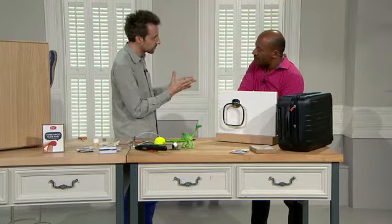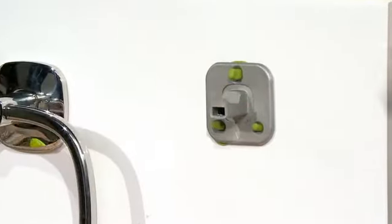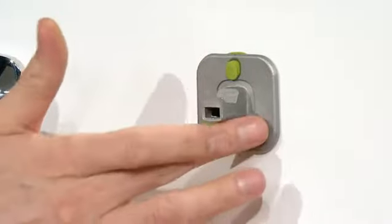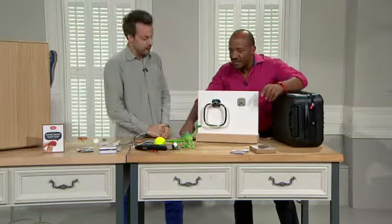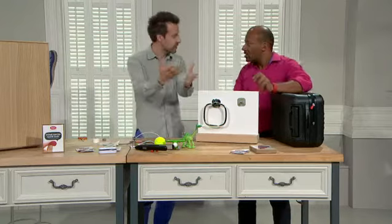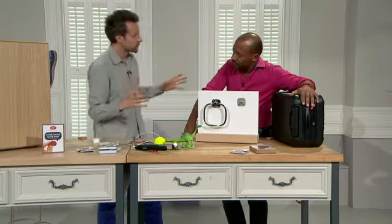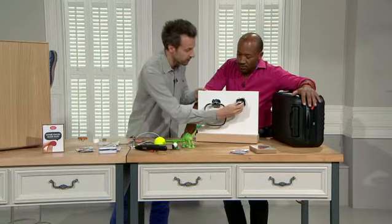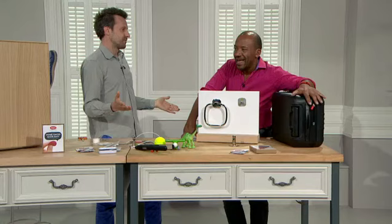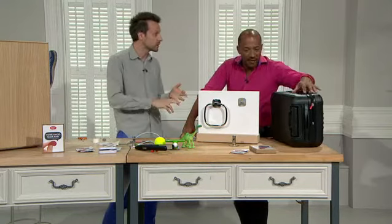With mounts like this you've got quite a large surface area. When you press Sugru onto the tile nice and firmly, Sugru just presses through. You've got plenty of time to get it straight, get it in the right position. At this point, if you wanted to change position, you could even pop it off and move it around, wipe it clean. I'm using green here today so the camera can see the product — on white tiles you'd use white. Leave it 24 hours and it sets to a strong, durable, waterproof rubber. Then you just pop on your accessory, and it's rock solid. No drilling, no banging — you can do your DIY at 2 o'clock in the morning. No drill, no mess, no stress.